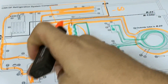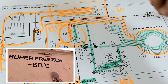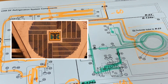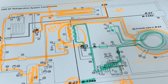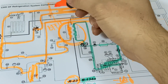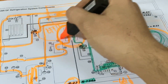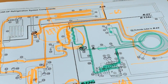The R23 evaporator is the one inside the freezer container, and the condenser of the R134A is the one exposed to the ambient air. They are coupling the condenser and evaporator of each system to have high efficiency for each other — they are helping each other.